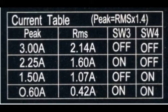The other tables on the top of the unit — this is the second one — and you have to set that for the current that the motor is drawing. This little motor, I've measured the current — it's just two or three hundred milliamps. So I've got switch 3 and switch 4 both switched on, because it's a very low current.